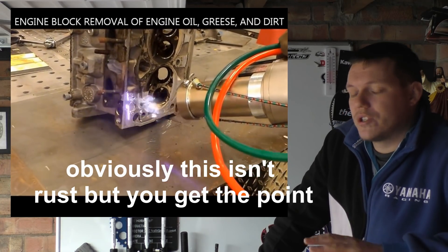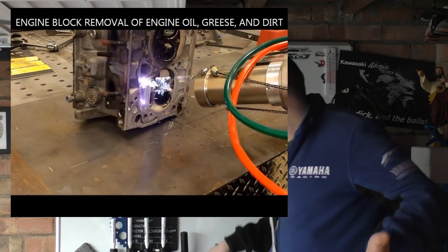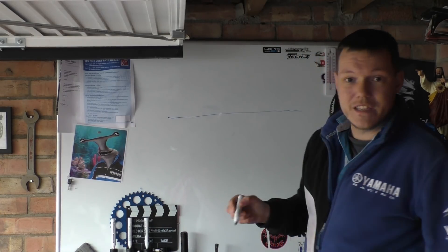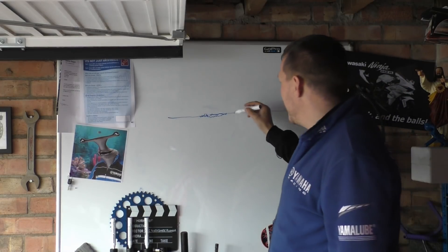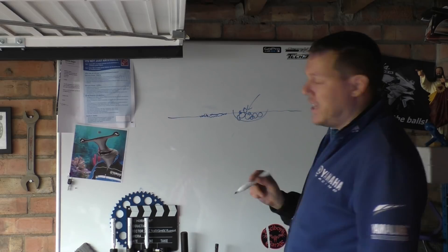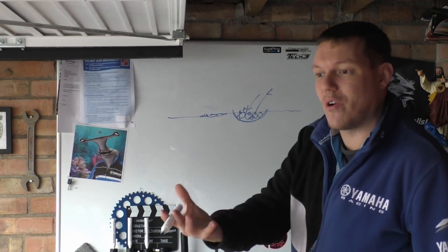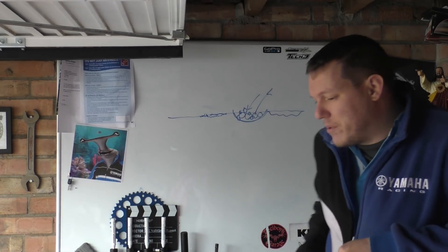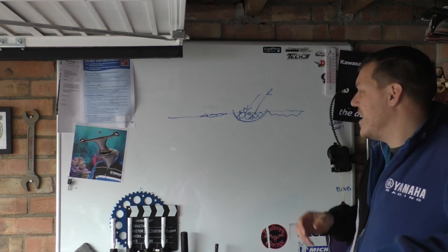The thing is it looks awesome, but what you have to consider is what the rust has already done to your surface. If you have rust and a perfectly clean steel surface, the rust is actually part of the atoms — oxygen has come in and attached itself to the iron and it's now a different material. When you get rid of it, you are literally removing steel — it's just oxidised steel that you're removing. So you end up with pits and cracks. Even with very light surface rust, you can treat it off using chemical products that just latch onto the iron oxide and pull it off, and you'll still end up with the same results.